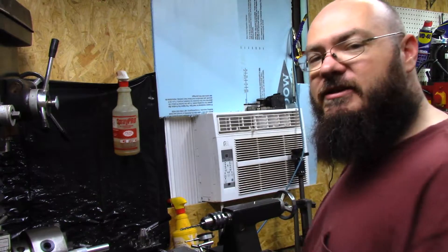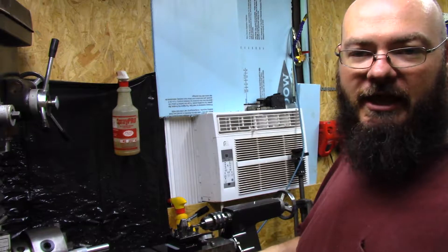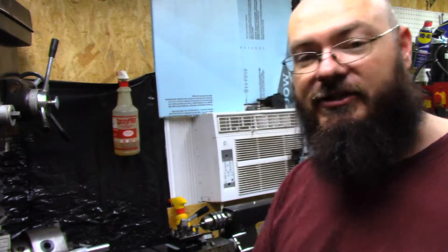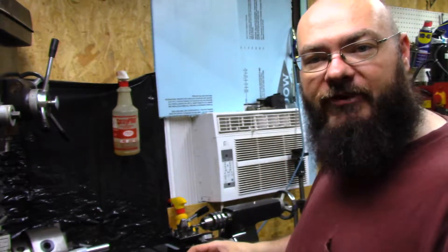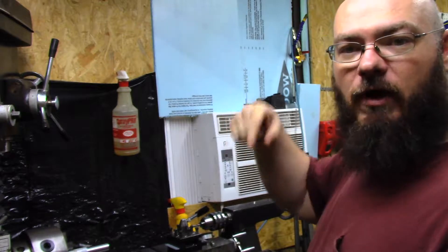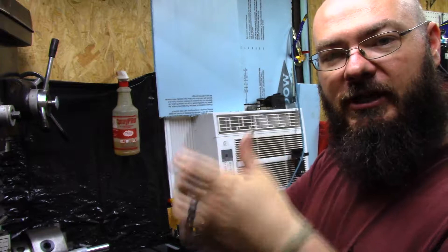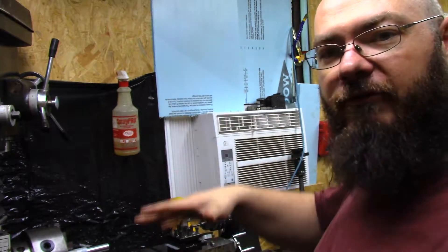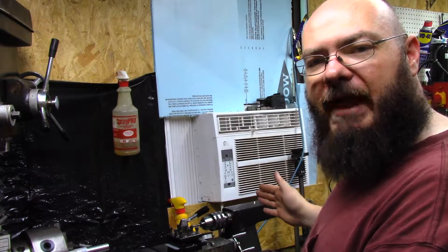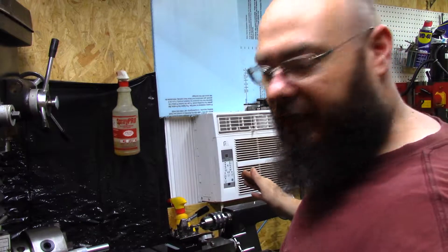Now the beauty about this machine, just to get it out there right out the gate, is this is considered a tabletop lathe. It's a big table, but I did build a steel table for this thing with adjustable feet — same thing I did for the benches if y'all watched that video — with welded nuts on the bottom with a bolt sticking out so I can adjust all four corners. Being such a short package, it's not that hard to get it level as it would be for a long bed lathe.